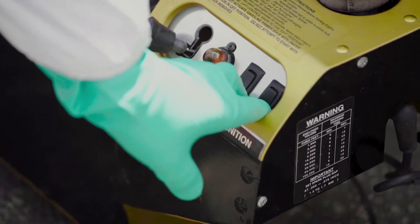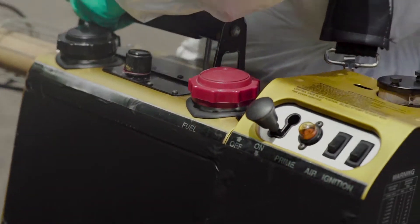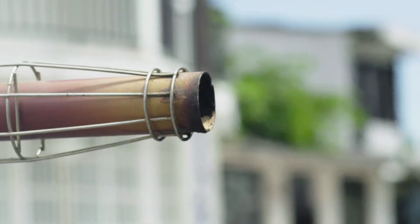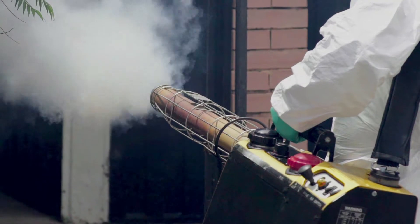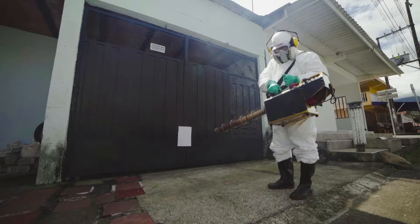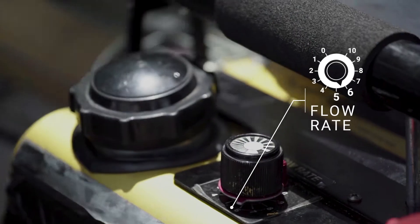The machine is activated by pressing the power button, which is located beside the fuel tank opening. Then, you should pressurize using the hand pump or air pump. When the spark plug ignites the gasoline-air mixture in the combustion chamber, gases exit the long exhaust tube, the end of which has a nozzle that injects the insecticide to be vaporized, producing a dense white fog. Once the machine is activated, the batteries stop functioning and the carburetor takes over, continuing the process of vaporizing the insecticide. In most machines, the flow rate is controlled by adjusting the discharge to halfway, usually to between 5 and 6 on the dial.